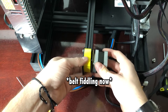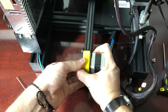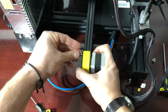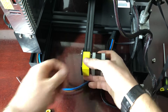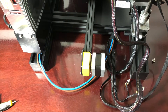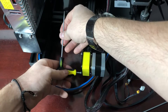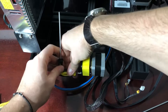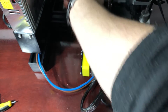I didn't remove the belt tensioner on the other side. Here we need two new screws — they are 25mm, which comes out a bit on the other side, but that is not a big deal as long as the end of the screw doesn't touch the motor, and this doesn't happen with 25mm screws. I am also using washers. Washers are a bit debated in the engineering community, but I prefer to use them especially when dealing with soft materials like aluminium and plastic. And this side is done.